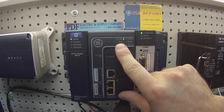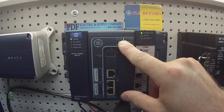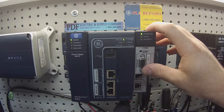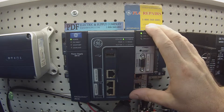I can tell the backplane is powered because the CPE processor is able to go through its self-diagnostic and then stay steady with a green LED, and the same goes for the ETM001. So make sure that you have modules in the rack that you can power up and that you can see they're on and working.